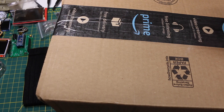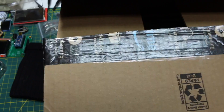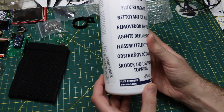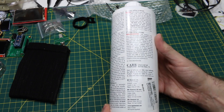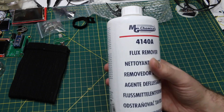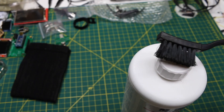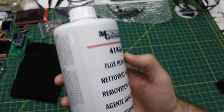Here's something I ordered because I'm always struggling to get flux cleaned off PCBs, so I thought it's about time I get some flux remover again. I haven't used this in several years. This is 945 milliliters. The last time I used flux remover it was in a spray can format with a straw, and it just had too much force — I could never really control where it was going. So I got this, and it's cheaper in this format. I figured I can dump some into the cap or a container and use a cleaning brush to target the area of the board I care about. Of course, we'd want to read all of the fine print, make sure we know how to use it, and then give it a try.